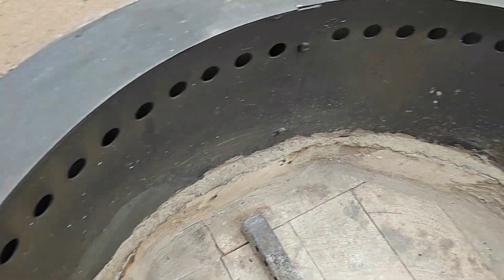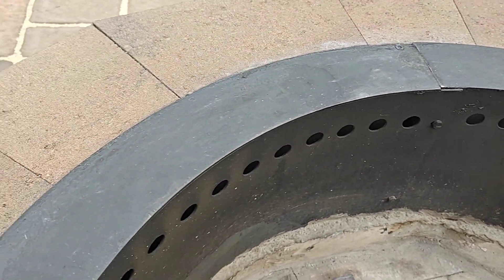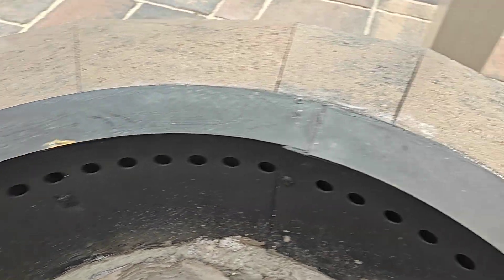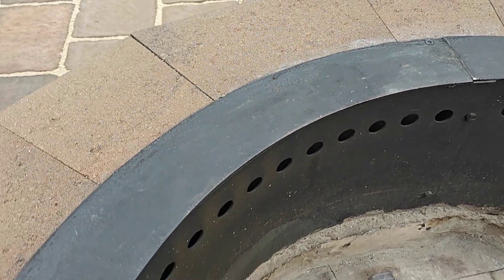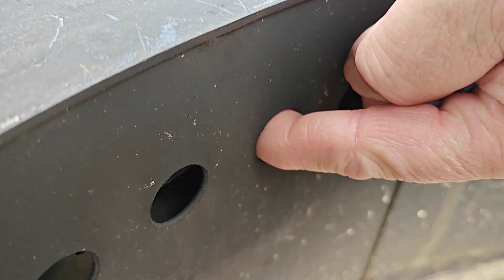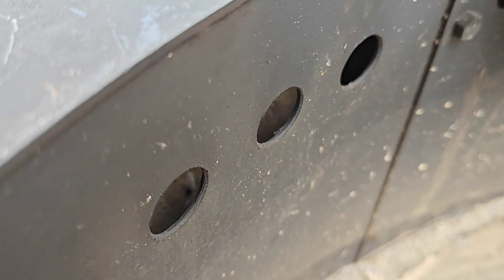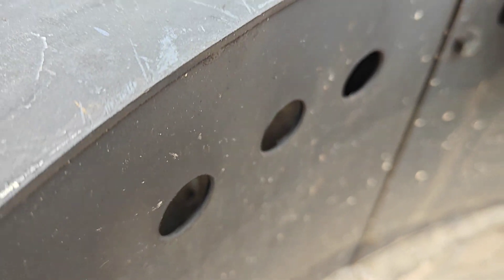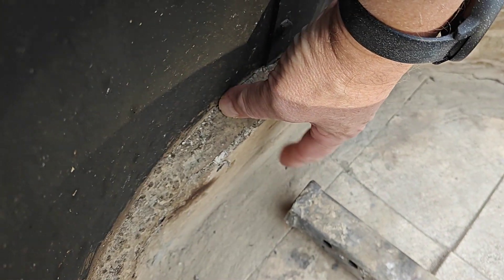When I put all this in, I sealed the inside of the retaining wall blocks with refractory mortar, so there should be no air coming through those concrete retaining wall pavers. If you look in the holes here, you can see there is in fact a gap — roughly about one and a half inch gap between the metal ring and the wall. This is fire brick, sealed off with refractory cement right here.